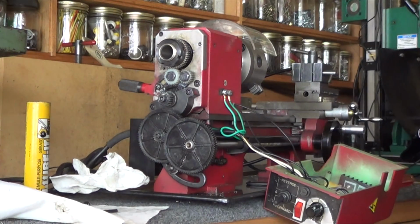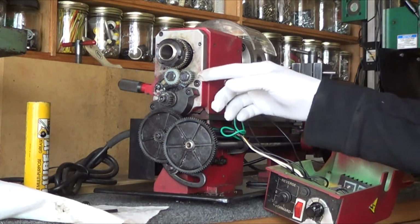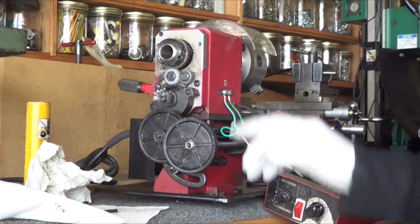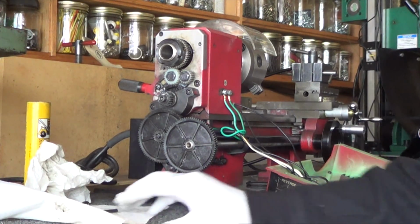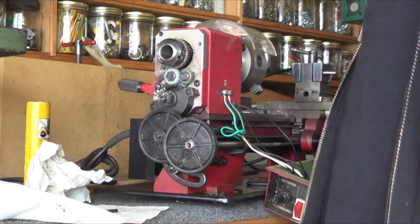See, I had messed with the gears because I changed them out to try to do some threading on the machine and put the original ones back, but I had it misadjusted, and so I wound up wiping that one out. This chip is no doubt from an accident where something jammed while I was turning something. So no big. Order that gear, and the timing belt. And while I'm at it, I might as well order another steel insert that I had shown, because I'm going to be paying for shipping, so throw the insert in there. So that's the update on the lathe.